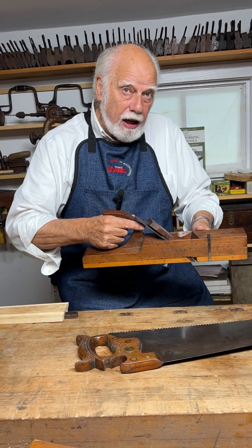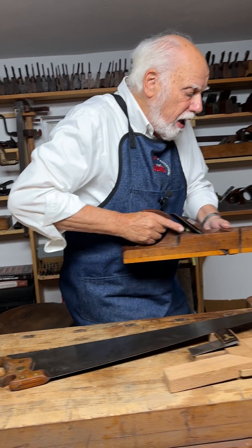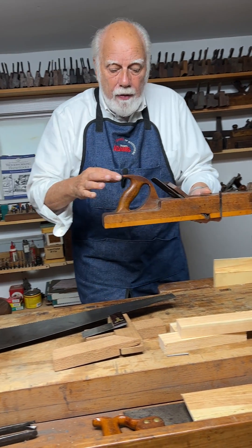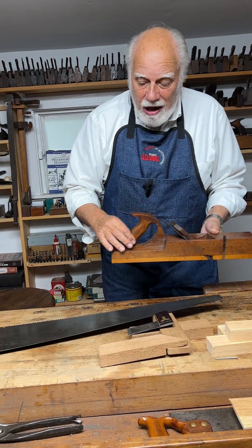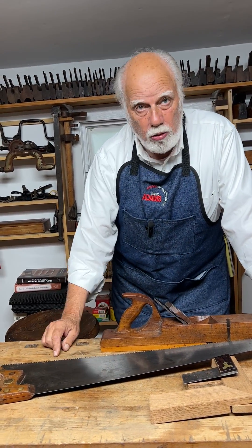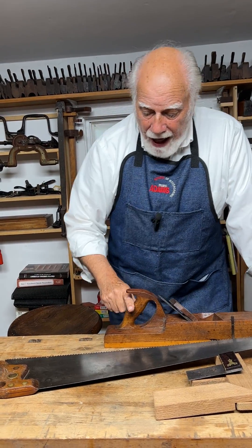It's because when you're planing, you're not only planing forward, but you're also planing down. And the angled tote equalizes the effort that you're putting in — that's the reason for a tilted tote. Three fingers and at an angle.